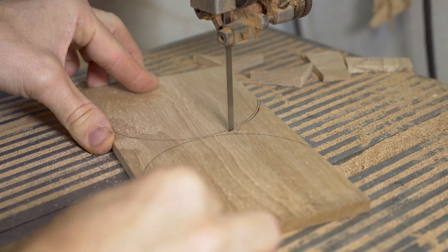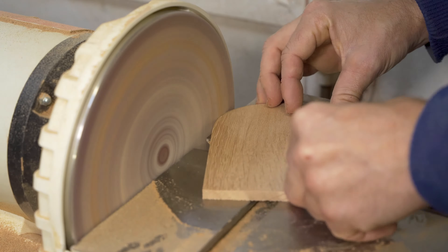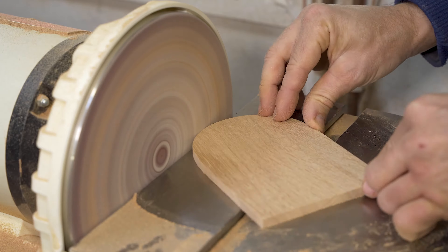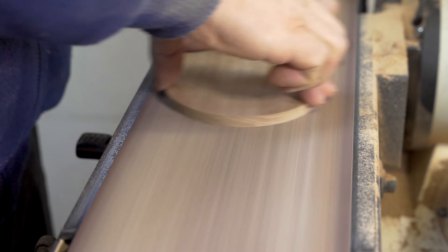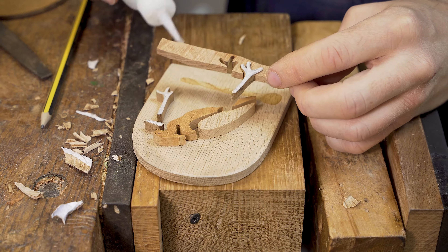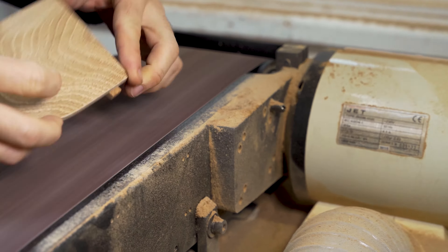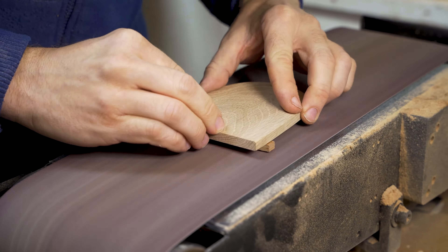From there we're marking out to create a back for our projects. We mark it out on the wood then use our bandsaw because it is quicker than the scroll saw. We cut that out on the bandsaw and then go across to our belt sander just to smooth everything off. We round off that shape, sanding down to the line and taking off the outside edge. We then use increasingly fine P-grades of grit to get a nice smooth finish. Once we finish sanding, we work again with that Starbond super glue — check the description, there's a link and a discount code 'lovespoons'.